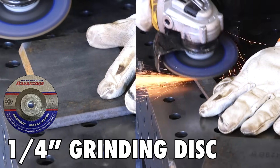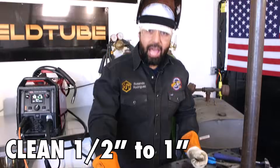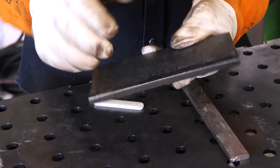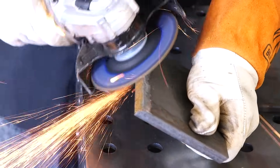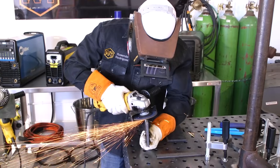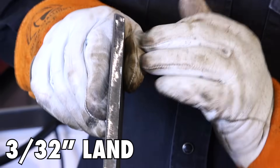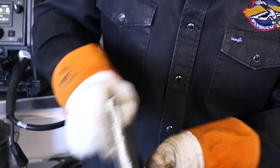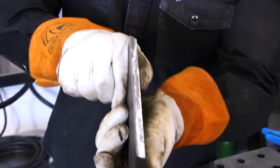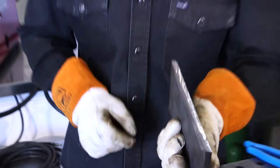You don't have to go all out. You don't have to clean your whole plate — just wherever you're going to place your weld. I only went maybe about a half an inch to an inch onto the plate. That's it. Front and back — your bevels. Also, if you look closely, I went ahead and removed my knife edge on the plate, so I have a landing. I placed a 3/32 landing on the very edge, both plates. Nice and clean — front and back, your bevel, and a nice landing. 3/32.